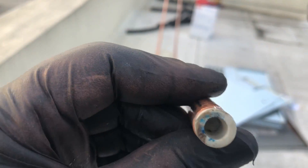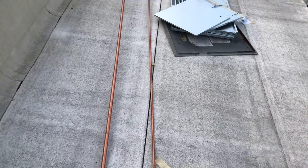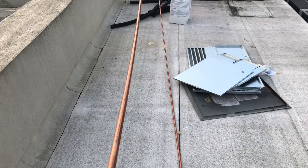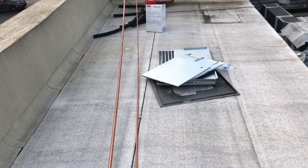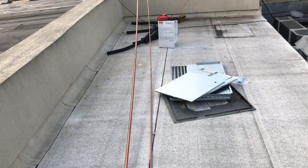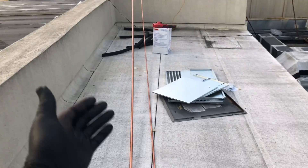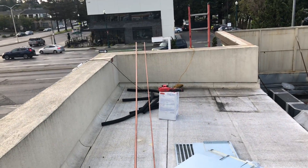Real ACR pipe - you guys always see that in my jobs. It's rated for 700 psi, comes nitrogenized, it's got plugs in it, it's hard drawn copper so you can't put a bender on it without annealing it. I'm just gonna use fittings today. This is real refrigeration pipe. I just always use this because that's how I was taught - we always ran lines with the ACR pipe. We never ran soft copper. If you guys ever wanted to see something funny, ask Dave to run a soft copper line set - it'll be a freaking disaster. I'm not a super tech when it comes to soft copper line sets, I totally suck at it. But when it comes to fitting pipe, I was trained to do this and I do it pretty good. That's the pipe I use.